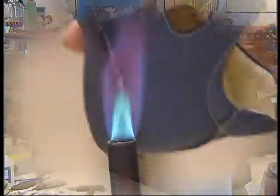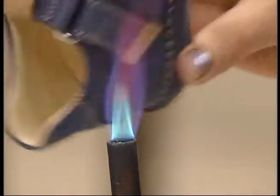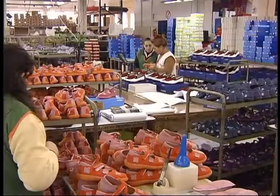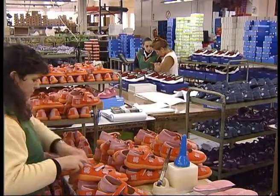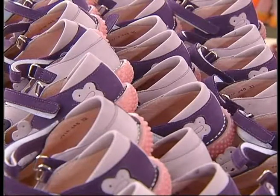To burn tips: this operation intends to eliminate the small thread tips that sometimes remain from the seam of the shoe and the seams of the upper. For this operation, a simple lighter, pickup gas, or a burner of tips through heat can be used. After these operations, we move on to the finish, where a considerable diversity of shoe finish products is used, varying according to the surface and desired effect, always considering the initial finish of the skins.